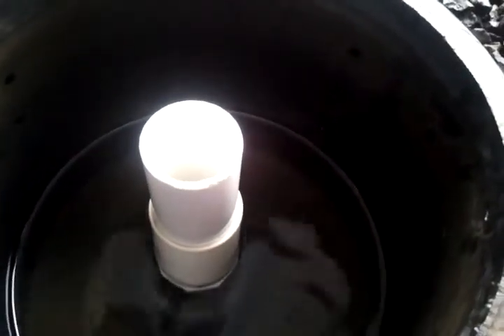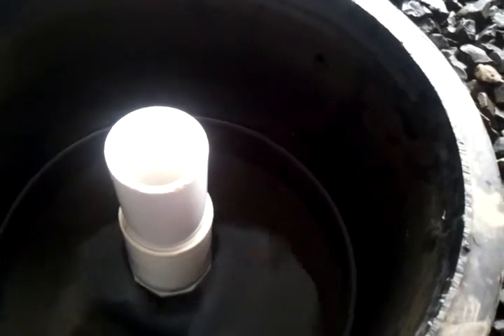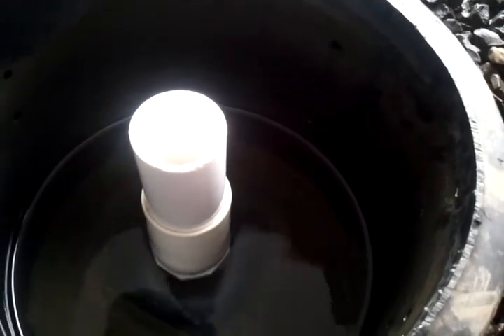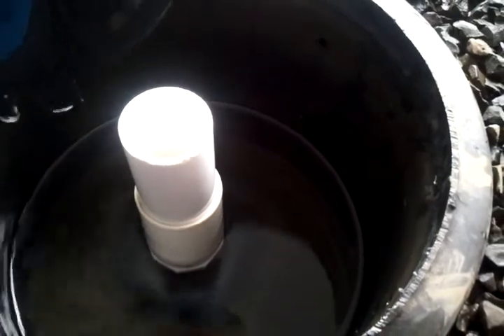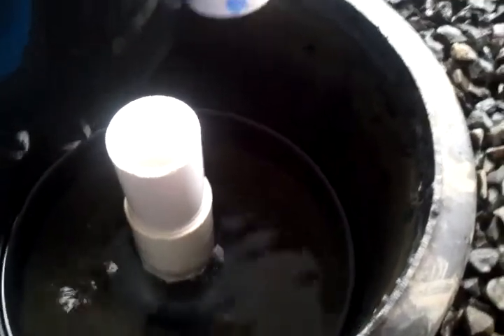There are the cutouts — there's just a big long area, so there's very little restriction for water to go in. There's very little restriction here because I've used a two-inch pipe down to a two-by-one adapter, which gives maximum flow.